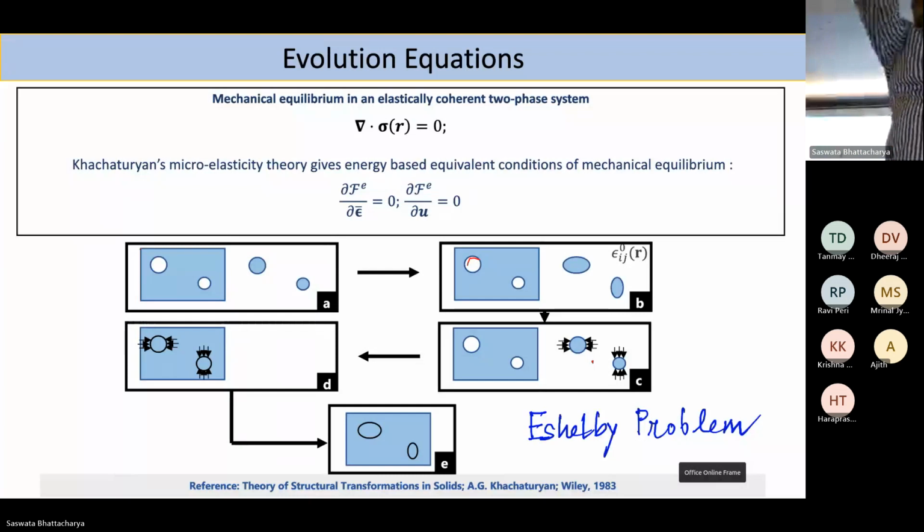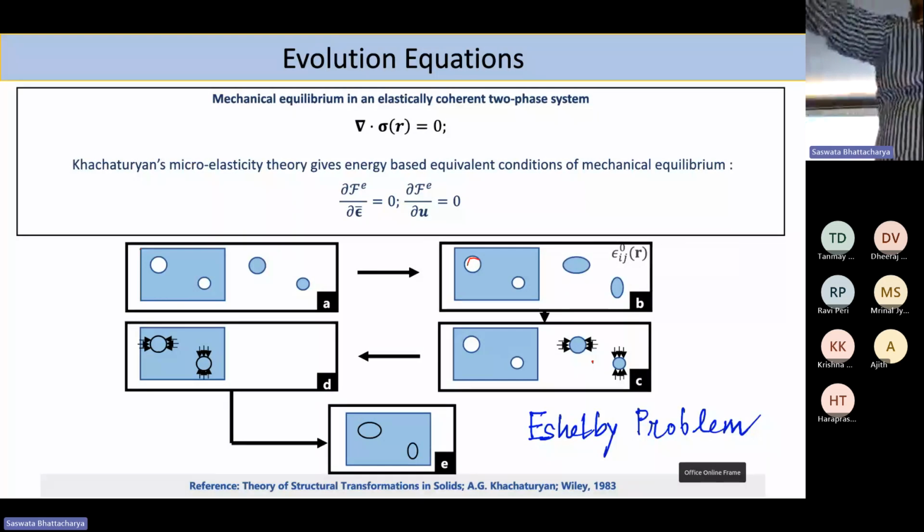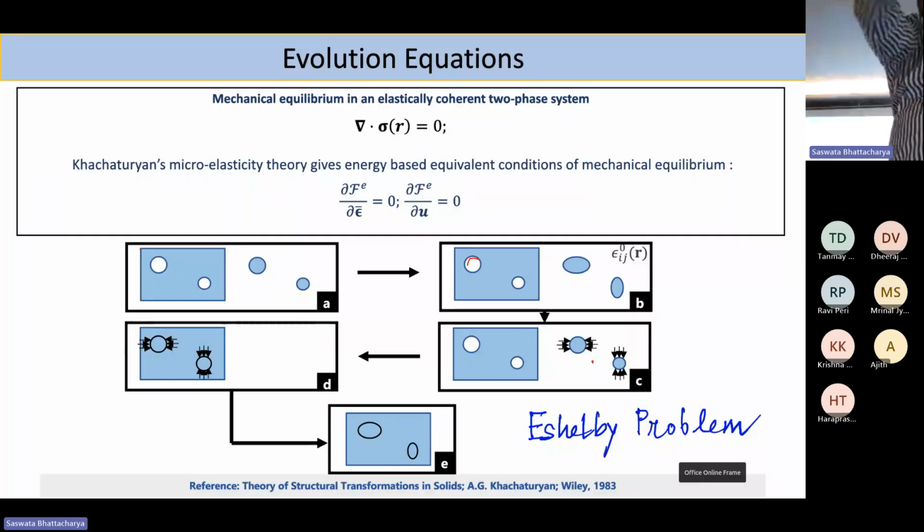If it is repeated all over space, are all of you from metallurgy? Some are from mechanical, but you have done some basic materials. What is a very important characteristic of crystalline materials? The structures are made of what? Lattice. Lattice plus motif is the crystal structure. And what is the unique property of a lattice? It is periodic. It repeats infinitely in space. But we can now use something called a periodic boundary condition. Now, what comes to your mind when we say something is periodic?